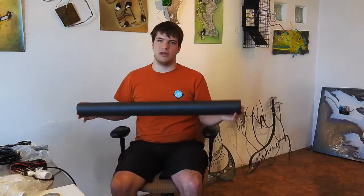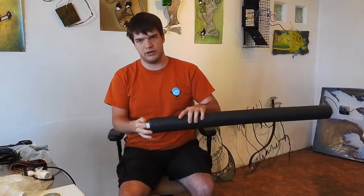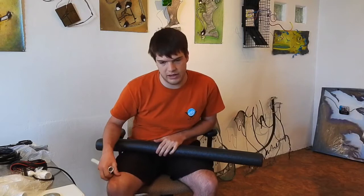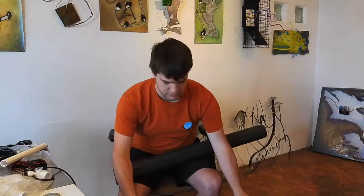The best way to add flotation is to use foam. If your ROV is too heavy, you get a bit of pipe foam like this — it's got a hole in it. You wrap it around there, maybe crank it down with some zip ties, and mount that on your ROV and it might float. An important thing about adding buoyancy is you want to keep it balanced — you don't want your ROV tilting in the water.